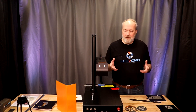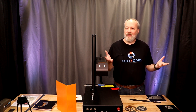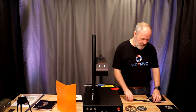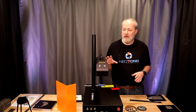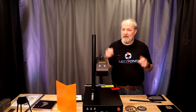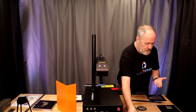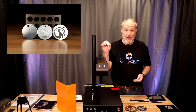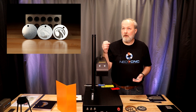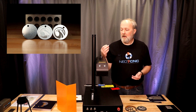Let's talk about what I was able to do with the machine. I kind of had to stop experimenting because I was having too much fun — I needed to actually do the video. The MOPA aspect gives a lot of tweakability and tunability to the laser. I had three anodized aluminum silver tags: one I messed up because I selected line mode instead of fill mode, so it just outlined the design — I can feel that with my fingernail, it really bit into the material, but unless you're right up on it, you can't even see it wasn't intentional.